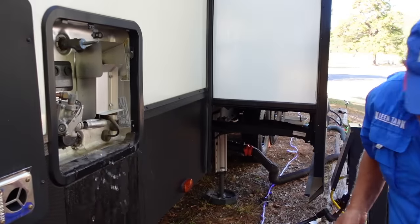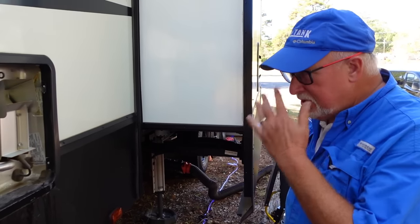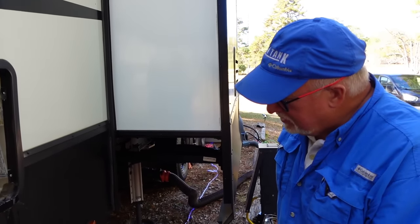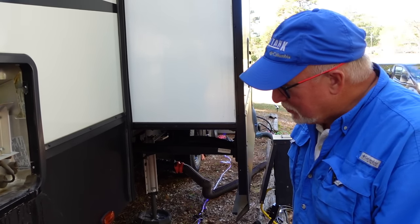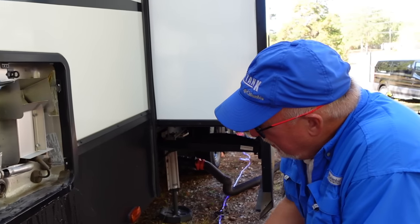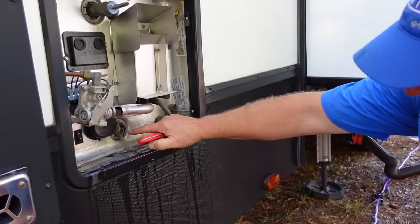Just drain that initial water off. We have a lot more RV tips and how-to videos coming out, so smash that subscribe button or scan this QR code with your smartphone to catch all of our videos. All RV water heaters are set at 140 degrees. Generally speaking you cannot adjust that temperature, but they mix to something that's a little more easy to tolerate in the shower. This particular one — if I look in here, we've got quite a bit of corrosion that's kind of built up in the threads.